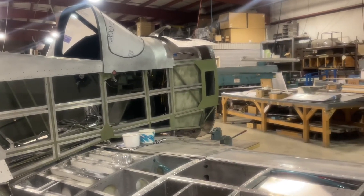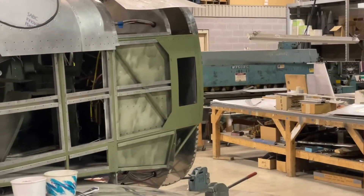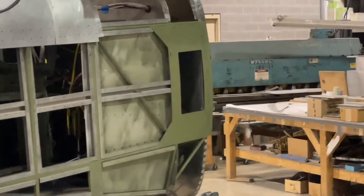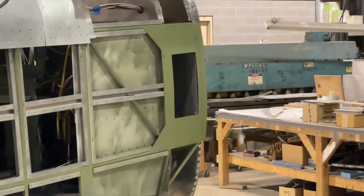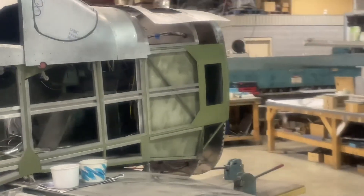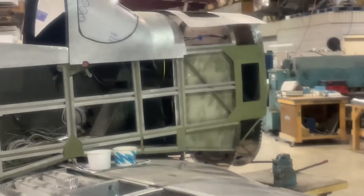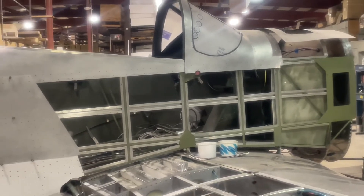The newer models that are going with a V8 — the frame is actually shorter in the front in this section, it's more narrow. You don't have room for a baggage compartment because with the heavy engine on the front, they pull it back a little bit closer for your center of gravity. That way you put as much as you can in the back of the airplane to balance it out.